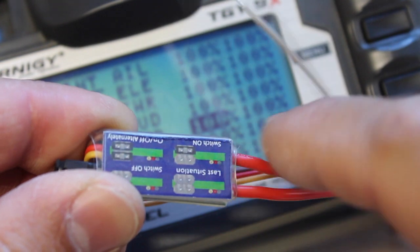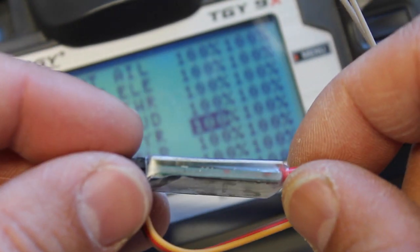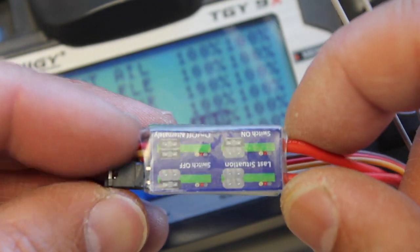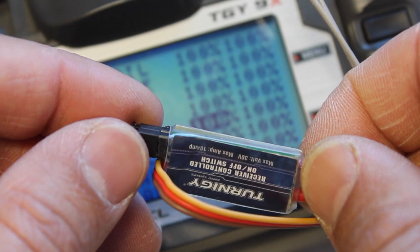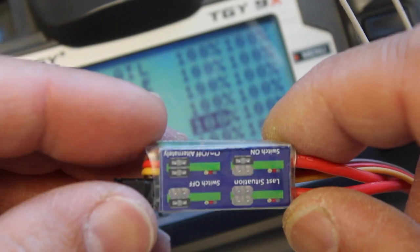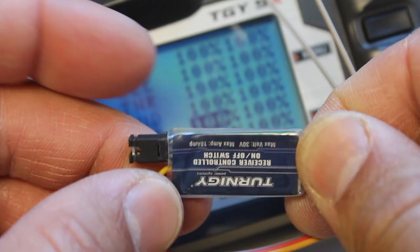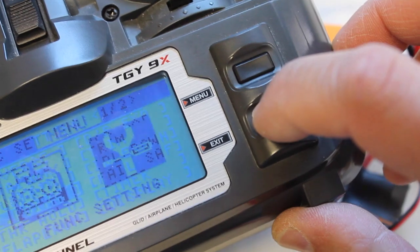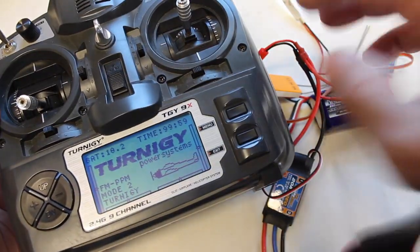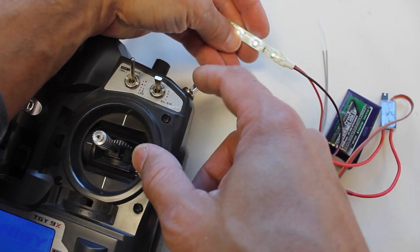And what I believe to be the case is this is just looking for something less than mid-range of a 1500 PWM and then something greater than that. So in doing that toggle, below 1500 and over 1500 is what actually controls whether or not the switch is open or closed. And even with my endpoints at 100%, which are the defaults, I just had 120 for a previous configuration, you'll see that the switch works as expected.